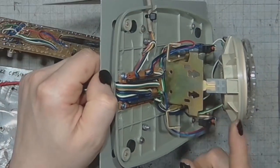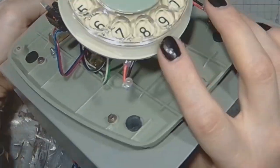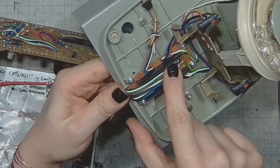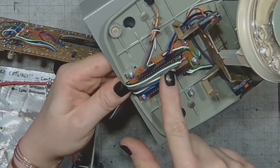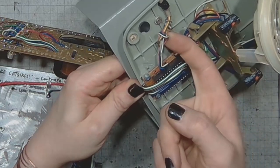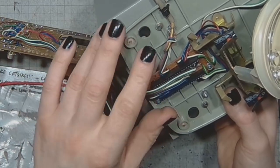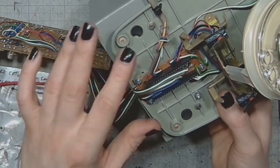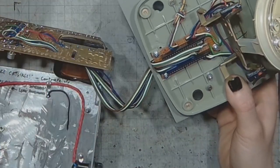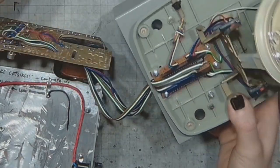We've got two switches. The rotary dial and the LEDs go to the perf board with the sockets for the Raspberry Pi. Here, this is left for the future. I'm planning on adding an open board for the handset speaker and microphone.